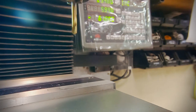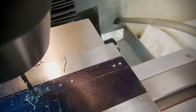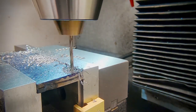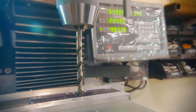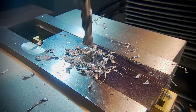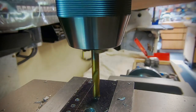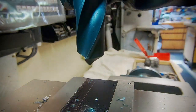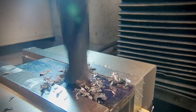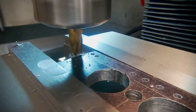Next up, a row of 2.5mm holes to match the frame, starting with a spotting drill. I've also cut in some large 17mm holes — these will form the shape of the plate. I then use a 10mm end mill to cut the remaining shape of the plate.